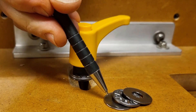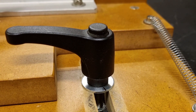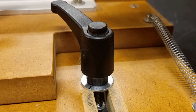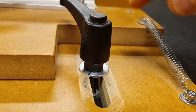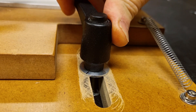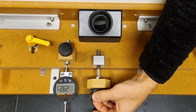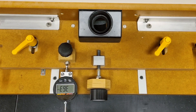If we compare that with a standard washer — I put a line on this one so you can see — sometimes when you tighten your knobs or levers the washer rotates along with them. When you get this rotating washer phenomenon, it causes the washer to dig into the jig and can also cause a shift between the parts as the washer applies a rotational force on them. With the fixed lower washer and the axial bearing, I get a straight vertical force when tightening and no shifting.